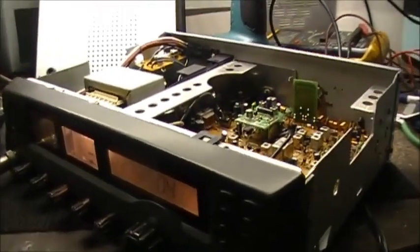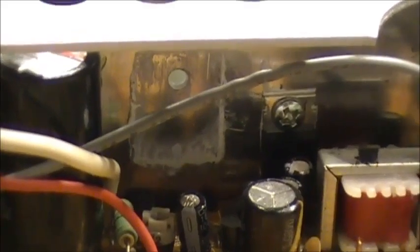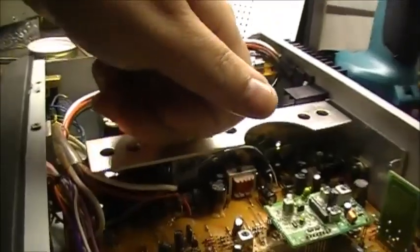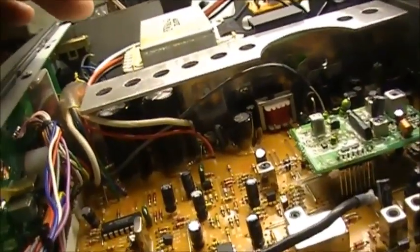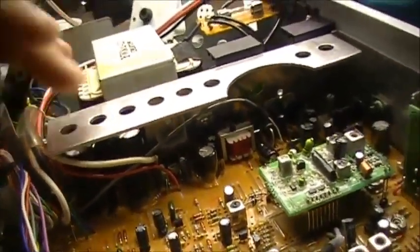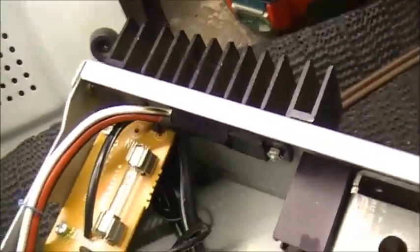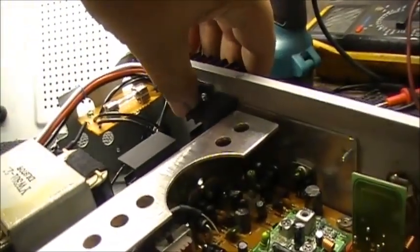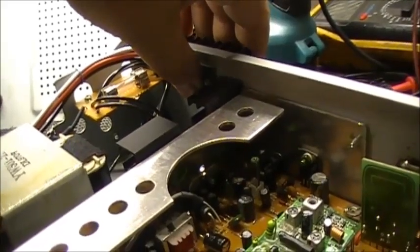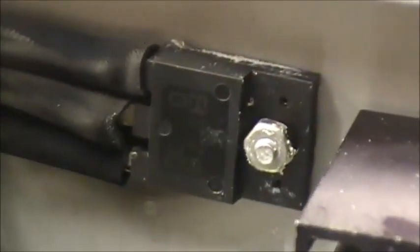Okay guys, it's jerky. CVS1000 again. So what I've done is moved the major transistor — that's causing all the heat. Everything was on the heat sink and it went all across to the regulator, to the audio amp, and the rectifier. It basically took the transistor out. I mounted it back here on the back panel, on an outside heat sink where it can dissipate heat. The transistor is still getting warm — too hot to touch — and it doesn't make sense why it would be that hot.